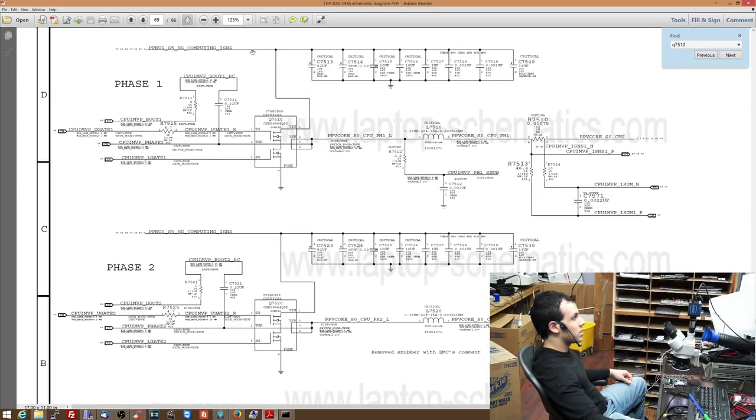And what's going on here is instead of this only opening when the controller tells it to, it's open all the time. So it's actually sending this 12 volts constantly. So instead of it sending a bunch of pulses that then get converted into 1 volt, only when the controller tells it to, it's constantly sending 12 volts in, which, by the way, it's a miracle that this thing still has a working CPU, because the CPU is seeing 1.7 volts instead of whatever it's supposed to.